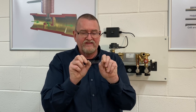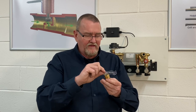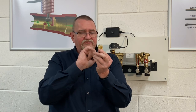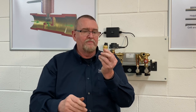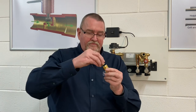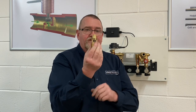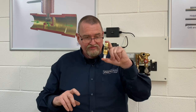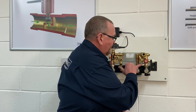Rather than replacing the whole unit, you can take that spring out and gently tease it to stretch it — just enough so it sits about a centimetre above the ring once placed inside. When you pop the bobbin in it should be supported by the spring. Then the piece with the flow restrictor fits back in on top. These components are available as spares — part numbers will be at the end of the video.